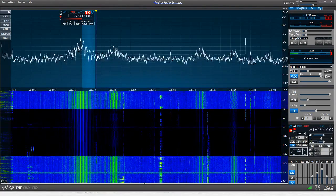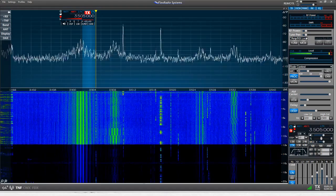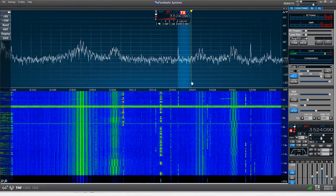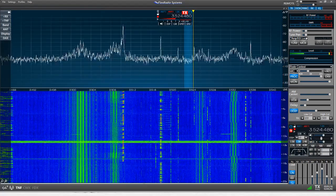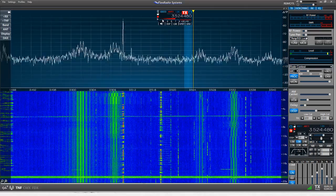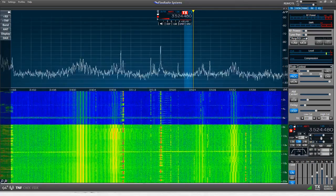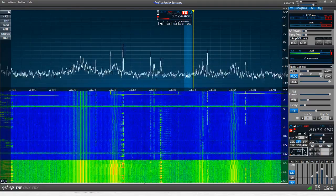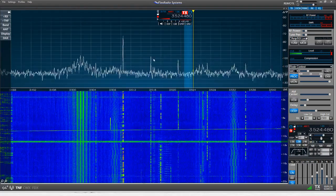On the order of about 30 dB or so — pretty significant. It can really improve your noise level and, more importantly, your signal-to-noise level when receiving. We can even head over to a part of the band with no activity. With the delta loop we're sitting at about an S7 noise level. Switching over to the magnetic loop drops you down to about S4 — a 3 S-unit improvement — which to me is well worth the money. We'll give you a little bit of audio so you can hear the difference in noise floor improvement.